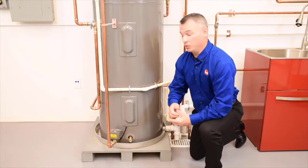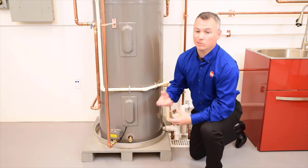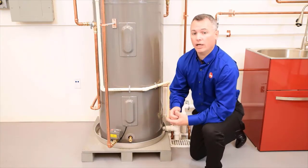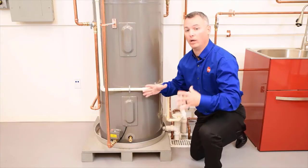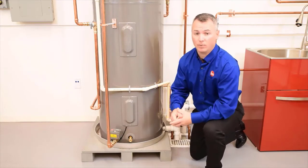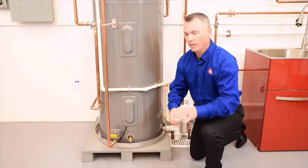Another recommendation is to install the water heater in a drain pan. Again, this may be a code requirement where you're at, but some locations don't require them. Depending on the model of heater that you're installing, the water heater either has a 360-degree built-in leak detection device all the way around the base, or it has an integrated leak detection rope that's designed to lay on the ground in close proximity to the heater, or it may have the ability to add that leak detection rope on at a later date.